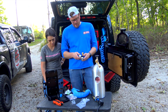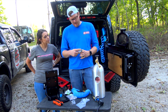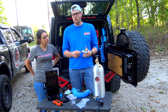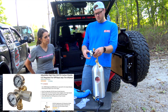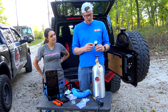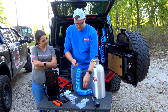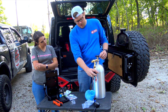This is another one of the regulators — it's like a safety regulator. It does have a PSI gauge on it so you can tell how much PSI is left in your tank. This one will only let you go to a maximum of maybe 150 PSI — I'll have to double check on that. But it would go in the same spot as a regulator for this tank. This one just doesn't have a gauge on it, but it does have a hole for a gauge if you wanted to add your own. There should be a screw-on brass fitting so you can hook that onto your hose.